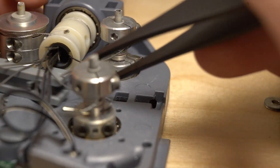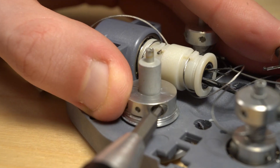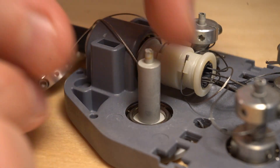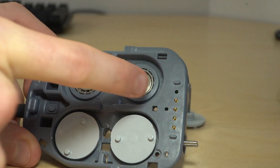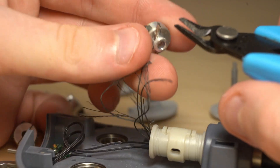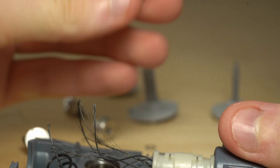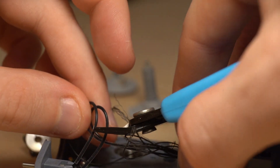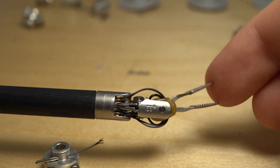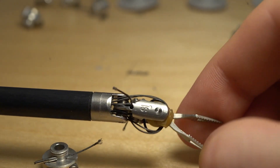Now we can start removing all the pulleys. When unscrewing them they sort of unfurl from each other due to the tension - they are two separate pieces and both come off completely. The shaft has some sort of very hard coating but is probably some sort of aluminum. The cables are actually pretty tough steel, which makes sense since they need to be bent around really small radii all the time and must have very high fatigue resistance. Once all the cables are cut, the end effector loses a lot of its rigidity - a lot of the device's structural rigidity comes from the tension of the cables.